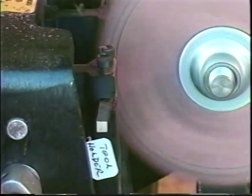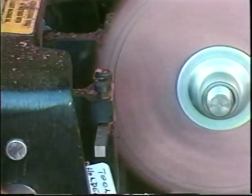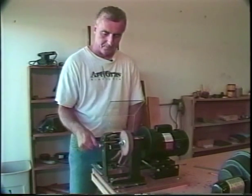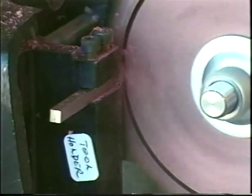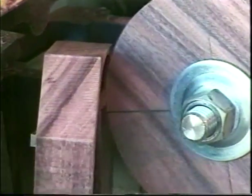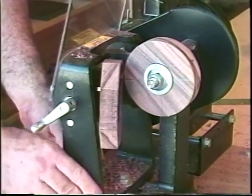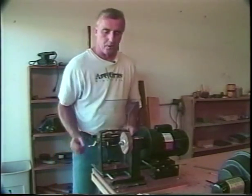We know exactly where we're going to make that cut. Now that we've got it set in the vertical, we just do the same operation, cut from the left. There's our first cut, which just makes our stock round instead of octagonal. These are our extra waste pieces. Now we want a ring from this.